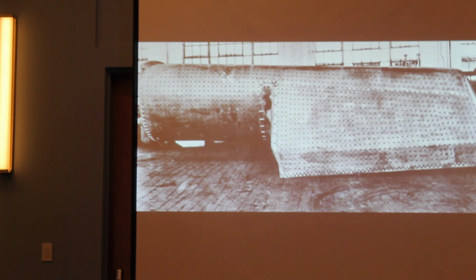Take them out, and you have to cut each end off nice and clean, like this. And then what they did was they added a new section onto the old tube. And what they did then, they forge welded those. You get electric welding, and forge welding is a combination of heat and pressure. So the N&W devised a machine that would do both. It would heat up the end of the new one and the end of the old one. After they cleaned the scale off, they would put these in a big roller all together and let them run around for quite a bit and knock all the scale off of them. And then they prepared both ends, and they would forge weld them. So they put them together, and the machine would heat up right here for about half an inch or so, and then at a given point, the machine would put pressure on there and push them together under that high heat and pressure and let it cool, and it would melt themselves together to make a new old tube.